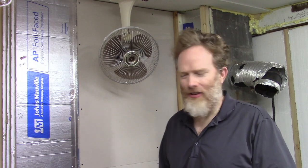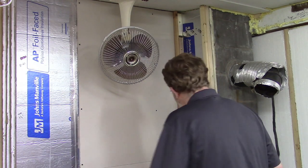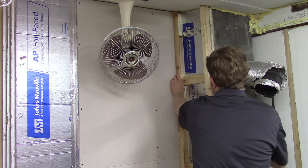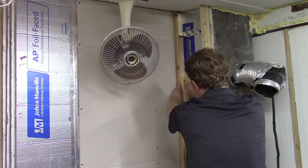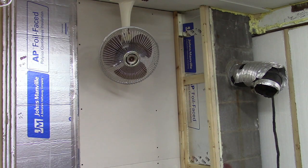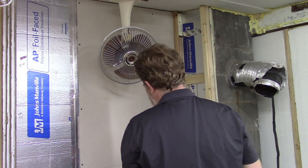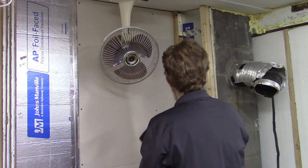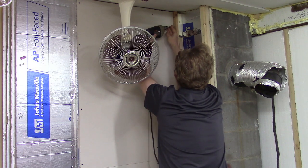This is just some of the stuff I'm working on when I'm not painting — just trying to slowly get this building fixed up so I can really paint here comfortably and not have an arm and a leg charged to me every winter in heating costs. Right now I'm attaching this last piece — this one-by-two — setting it up so this width matches the other side. Then I can put some insulation inside, drywall on top, plus a little piece of metal as a shield against the heat from the heater. We're going to take a couple of two-inch screws and just screw these in, and that should finish this off.